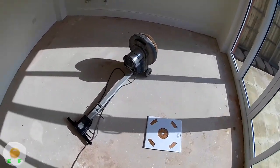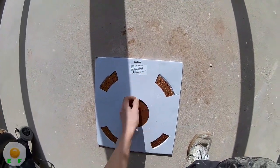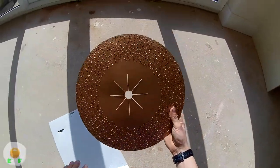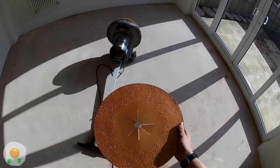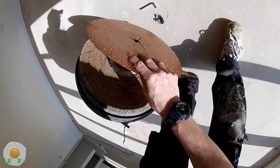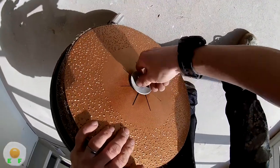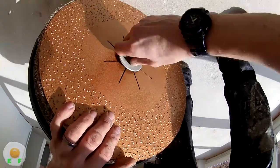Hi and welcome to another video by Eggy Fitz. In this video I'll be showing you what I do to prep an anhydrite floor. This is a copper plate which is double-sided, and we'll be attaching it to a floor buffer or floor sander. When you attach it to the floor sander, the thread on the bolt should be anti-clockwise to do up and clockwise to undo, so it doesn't unwind itself when it's spinning.